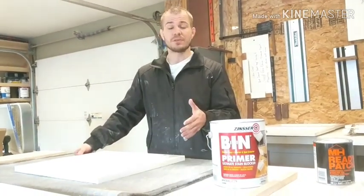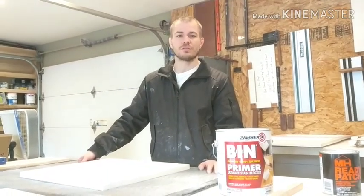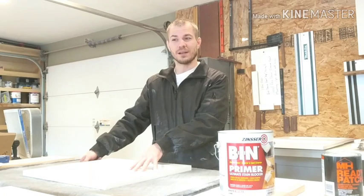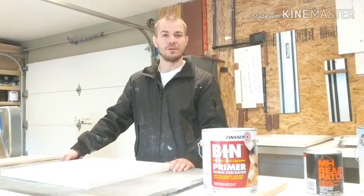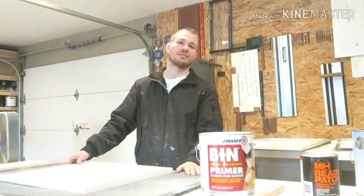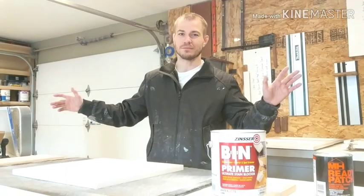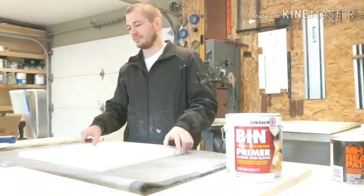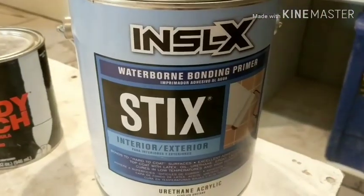Not a lot of people have shown videos of them actually doing this. There are a lot of grain filler products out there — I've tried a few and haven't gotten great results. If I ever have to do this again, this is what I'm going to do. But as a professional whose time is very important, I'm probably never going to do this again — it would have been faster to just completely remake the doors. If you're a hobbyist looking to do this, only consider it if you have a fantastic sander. But if you're not that serious, just paint it even though it looks like oak — don't even worry about filling the pores.